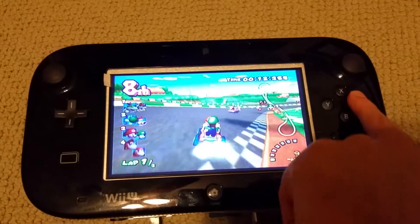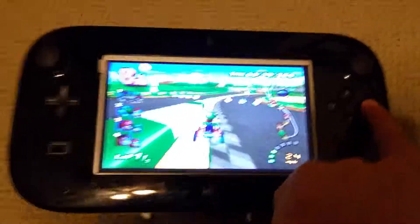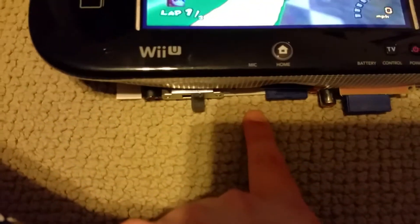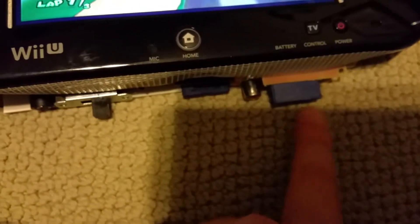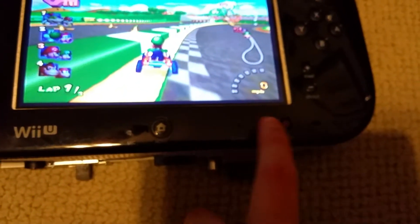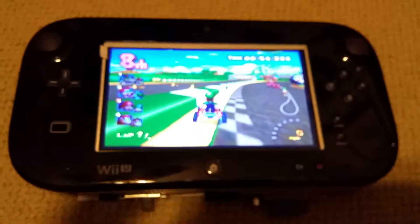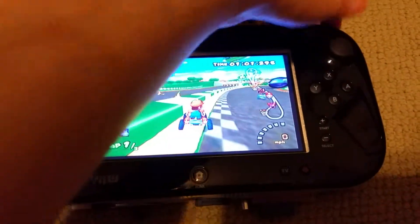Okay, so that's this guy. Down here you've got your charging port, your power switch, and this is just a vent — it's not fabric, it's a mesh material. This thing gets a little hot so I put some of that on the sides. There's an audio out, RCA, and the SD card slots as mentioned. These buttons are not functional — I could not get the tact switches that came with the gamepad to work correctly, so Z is mapped to select rather than RB or something.